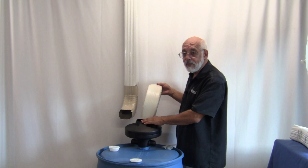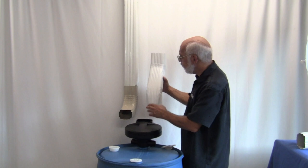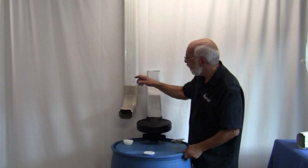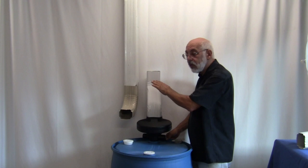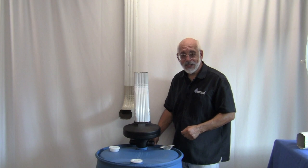For something that's closer to the wall, this is called an offset elbow. This would go into the top of the unit, and then I would come over to the downpipe, make my mark straight across, and come down about half an inch. These are the same outside dimension, so this one needs to be crimped or coned down a little bit so it will fit inside. Then we can make all those pieces together. We've got a nicer-looking unit than the double elbow, and this unit will keep us snug up against the wall. So those are a couple of ways of installing the UFO Downspout Rainwater Harvesting Diverter Kit. We look forward to your order, and thanks for watching.